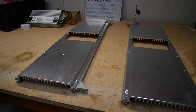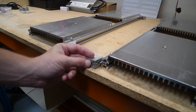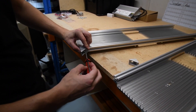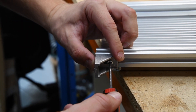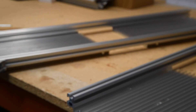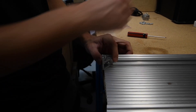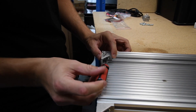Here we have the kit with all four heat sinks and rail completely mounted. Next, put corner units into the t-slot using t-slot screws and nuts, mounting them flush to the edge of the heat sink. Four corner brackets are supplied — one set has holes which allow you to fit the eye bolts for hanging the entire system.